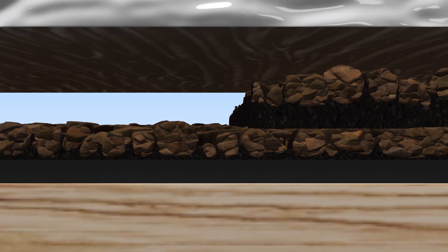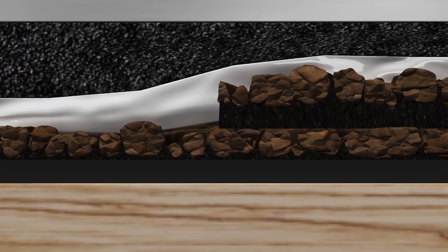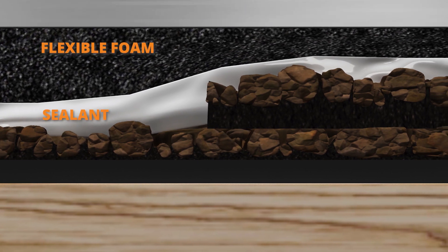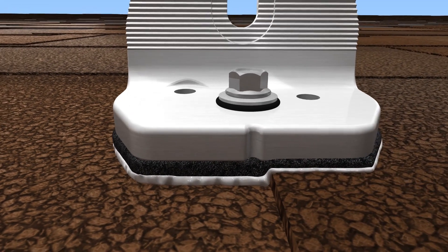Pre-installed dual pads consisting of one layer of flexible foam and a second layer of waterproof sealant provide cushioning, allowing the sealant to adhere deep between the shingle granules and to flexibly conform over the steps found on architectural style shingles.